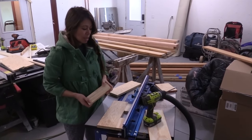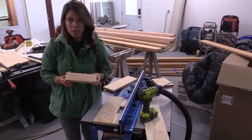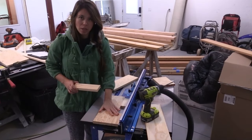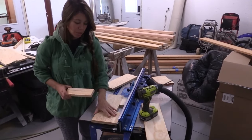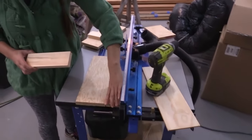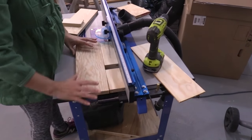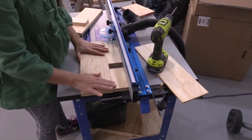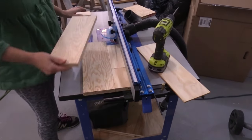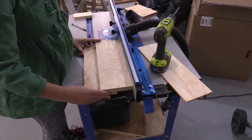For the cabinet we're making, we have to run these little pieces of wood through the router. You could just run it through but it's a little dangerous, so I'm making a jig. What I did is I took a scrap piece of the same material - just plywood - and then this is the piece I want to run through. It'll sit like this in the jig, and then put this piece on top, nice and square.